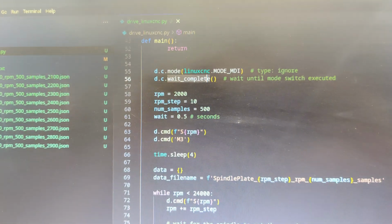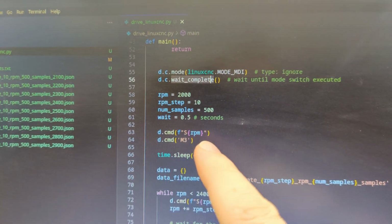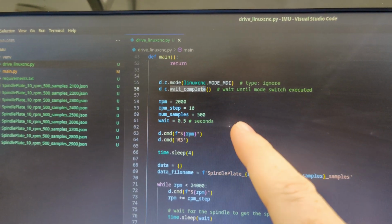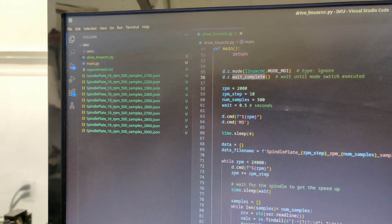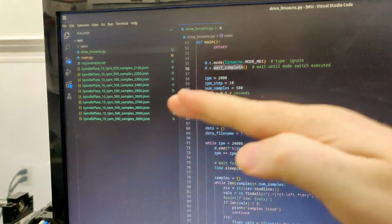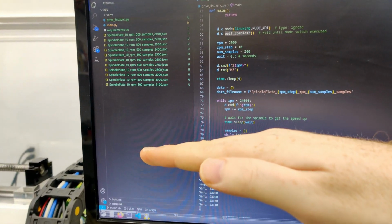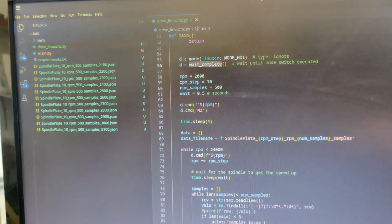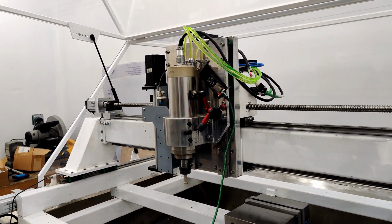And then the combo of that with, even if it, for whatever reason, has a hiccup and starts capturing samples before the spindle is up to speed, I'm capturing so much of it that it won't really pick up the way I'm doing it, basically by the amount of values. So if it's oscillating at, let's say, a value of 0.1, well, 0.1 is going to be oscillating, and then maybe negative 0.1 is probably the opposite one. So I'm going to be capturing those in order of their hierarchy in the samples and then throwing out the outliers. So changes like that will probably be an outlier, so it shouldn't be too much of an issue. So yeah, I'll stop here and start the recording of the final thing.